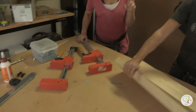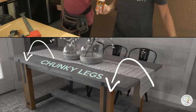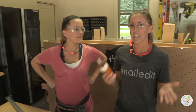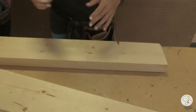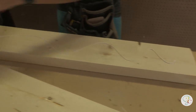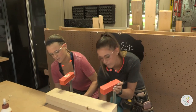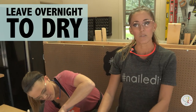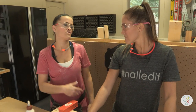One of the things we love about this table is that it uses really thick, chunky legs. Those can be really expensive to buy and hard to find, so we make ours ourselves. It's called laminating — we've already ripped the edges off the 2x6's, made them five inches, and you're just going to put a ton of glue on them and make a 2x6 sandwich. Clamp it up, let it dry, then sand both sides so the seam is really nice and smooth. Then you've got chunky table legs — like a $3 chunky table leg.